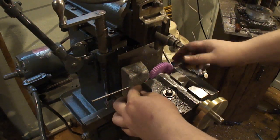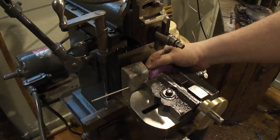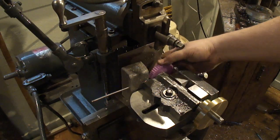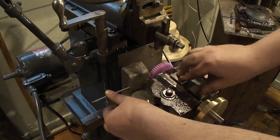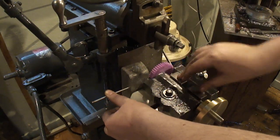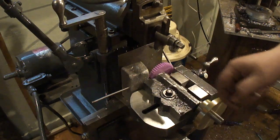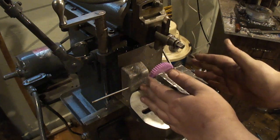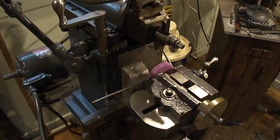It just has a hole through it. There's a spring right here on this pawl, and the end is shaped at a 29 degree angle so that it holds it tight in. So you press this down, lock up the table to take a cut. I know it's off center a bit. It's about 5 degrees, about 4.5, according to the sheets here.